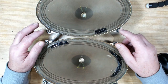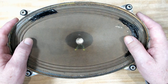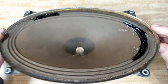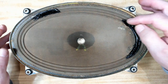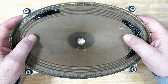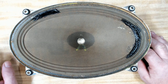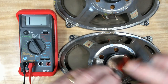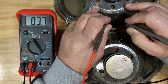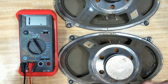The two speakers have been drying for a few days and I'm very happy with the way they've come out. I was able to remove all the masking tape from behind - it's quite clear now. All that's left is a very thin membrane of rubber material and I don't think it's inhibiting movement at all. I need to put some little bits of felt in the middle and these speakers are ready to go back. Something I didn't check earlier was the voice coil - measuring now: 3.8 ohms - they're both good.